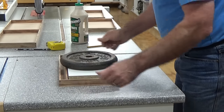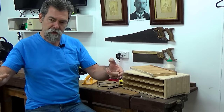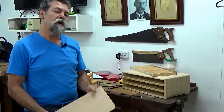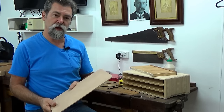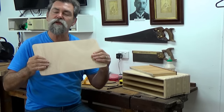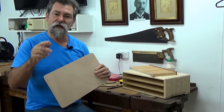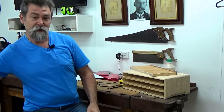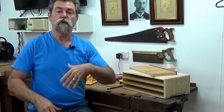Then get your weights and drop one on top, and leave it. If your board hasn't pulled totally straight and has a bit of a bow, you can put a clamp either side and pull it down. You'll find that once it's dried and been laminated onto the plywood it becomes extremely stable — it can't twist. It's almost like a torsion box; you're laminating this stuff, and laminated timbers are horribly strong and stiff. They will not bend.